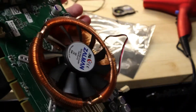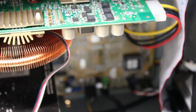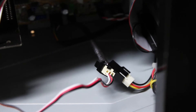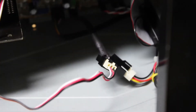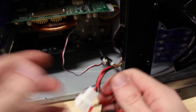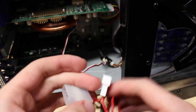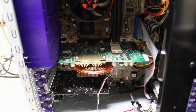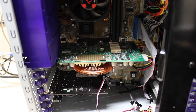Why don't we go ahead and put this in the computer and see what happens. One of the drawbacks of doing it with this Zalman cooler is we have to worry about fan headers now, which is kind of annoying, especially in older computers that don't have many fan headers. In this case I'm just using a little splitter here — it's only temporary. I would recommend something more along the lines of a Molex cable that splits off into a fan header if you plan on running it long-term. Here it is, sitting nice and pretty in the case.